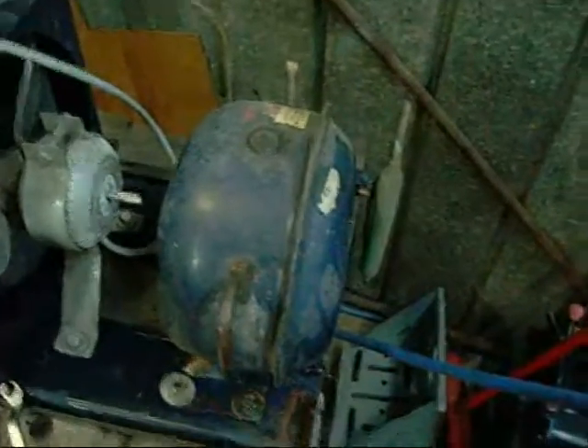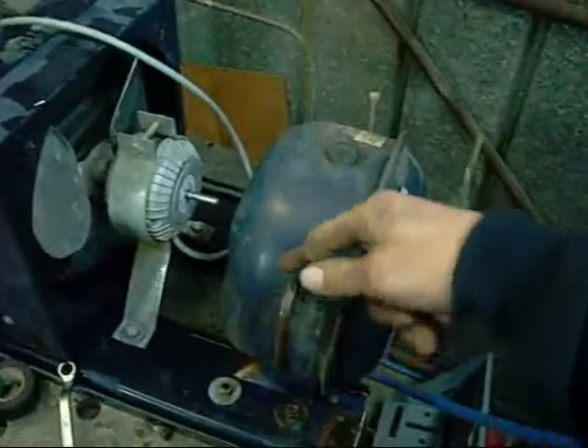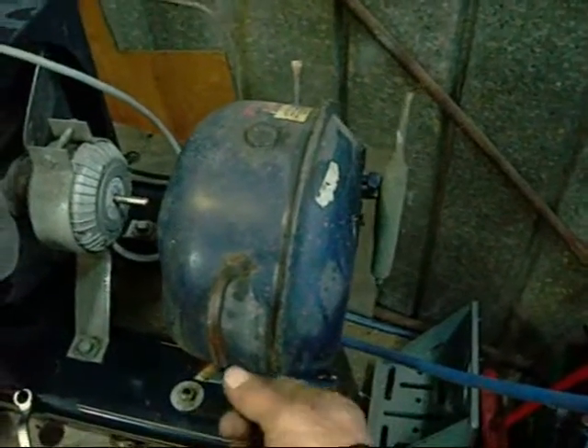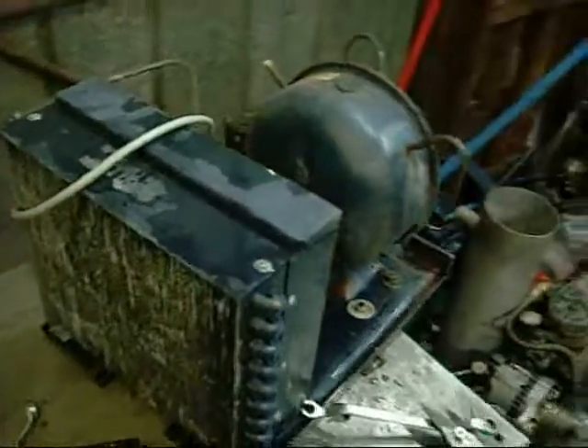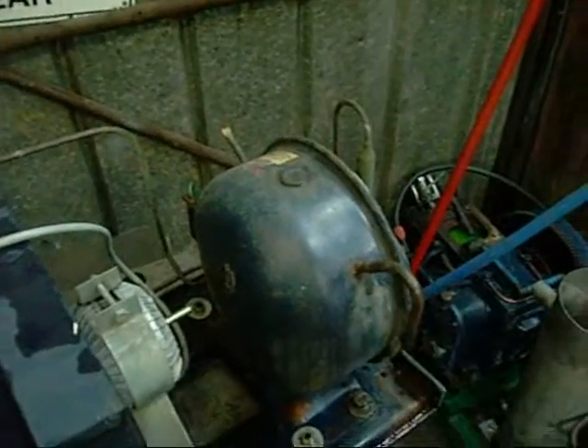Or at least I might as well oxy everything while I've got the set. I'll just clean up that bit down the bottom and solder the new king valve in — I'll just use a joiner, easy enough. Probably one of three units that I've got that needs an oxy set job.